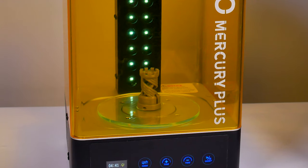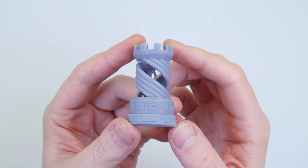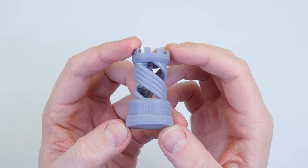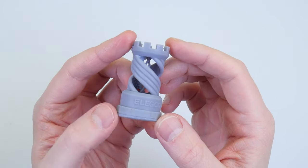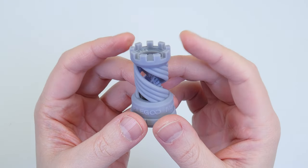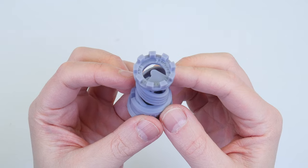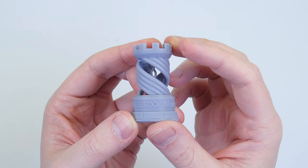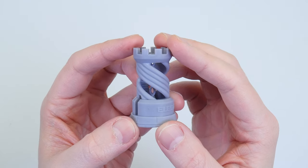Here's the aftermath of a few prints, getting cleaned and cured — honestly it's not that bad, but I do recommend having an area you're not worried about getting messy. Once our print has completely dried we can swap out the tub for the small circular platform, place the print inside, and start the curing process — it's going to be about three to five minutes depending on the size of your print. We can clean prints without the station and even leave them in the sun to cure, but the Mercury station has made the whole process a lot quicker and more straightforward. And since we can clean our resin with just water, no headaches — literally.